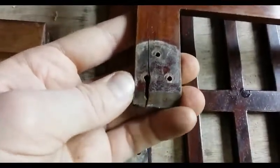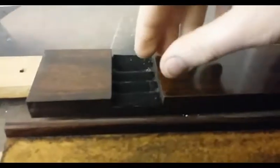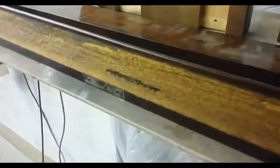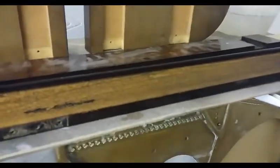This one has a bad one in it. People often say to us: why do you use animal glue, which is the older style of glue for gluing stuff onto pianos? Basically because if you wet it or heat it, it becomes liquid again. I soaked this about half an hour ago — I've just come back after my dinner and I can now just grab one end and it just gives up. No mess — I've just peeled that off. All that needs now is a knife running across the surface like that and it's completely clean. If that had been glued on with PVA or another modern type glue that would have been an absolute nightmare to get off and we would have partially destroyed the wood as well.